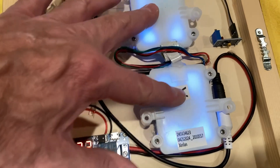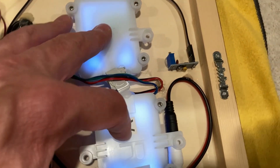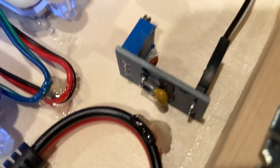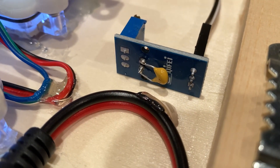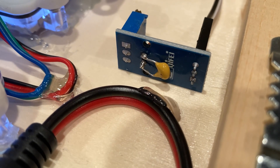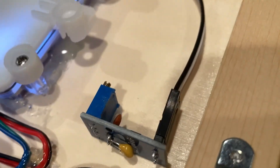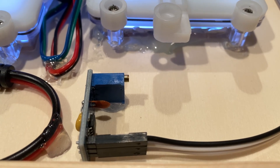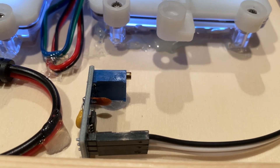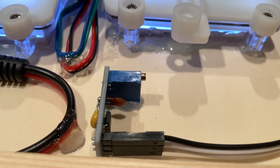Here's a timer that changes the LED eyes — every 60 seconds you get a new set of eyes. Here is the pulse generator that uses a 555. I've soldered on that 0.47 microfarad capacitor at the bottom of that pulse generator. I orientated it so I have access to adjust the variable flash rate on those LEDs — I can just turn that screw right there.